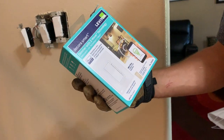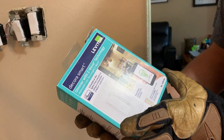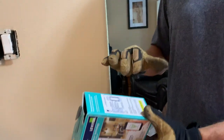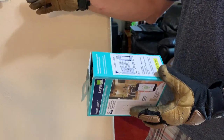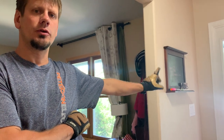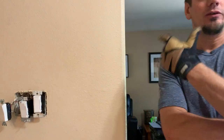But here's the thing — I did mess with Control4, I don't know if I like them as much. But here's Leviton; this is a decent brand, I really like a lot of Leviton products. I favor other brands for their GFCIs no doubt, but as far as this on the control side — this is an RF switch. You have to keep in mind on newer homes from 2012 and on, you're no longer allowed to rob Peter to pay Paul. So let's say over here we have power and over here we have a switch leg, and we're going to grab that neutral because it's over here and we're putting our master there versus our slave — you can't do that.